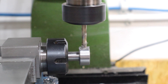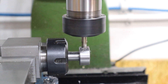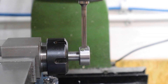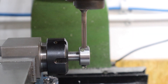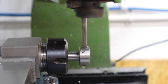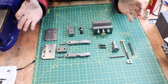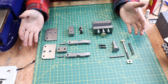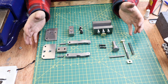Using a 6.2mm stub drill to get the majority of the bulk material out of the way, then coming back in with a quarter inch reamer as the silver steel provided in the kit is also quarter inch. After the last four videos, we now have all the parts on the bench and we're going to assemble this and see what the final finished product looks like.